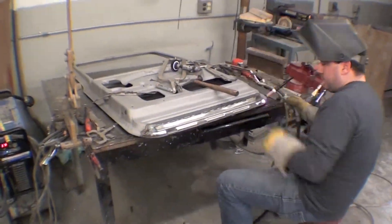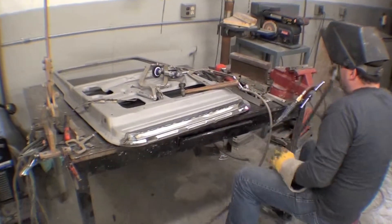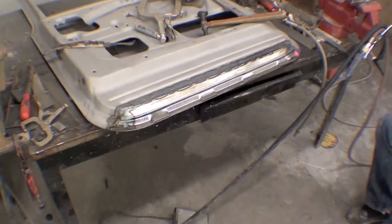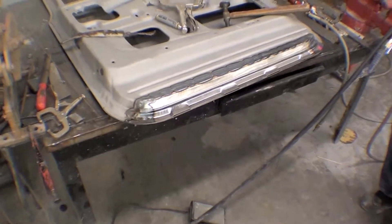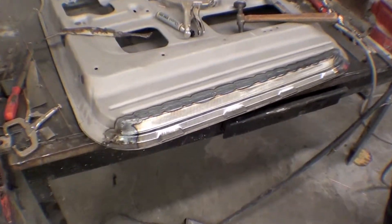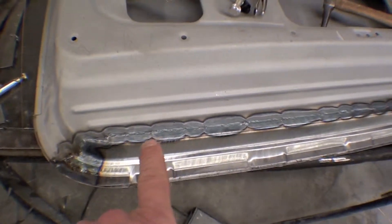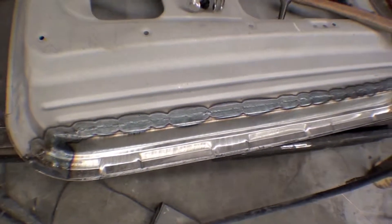You can see from the glow that we have the welding going on. It's all TIG'd up, almost — right about there. I got over here a little late, but after a few minutes here, you can see where he just runs a bead, lets it dry and cool for a second and goes on — keeps the warping down.